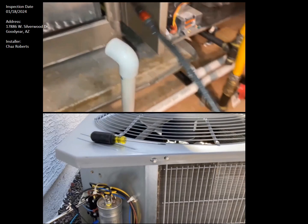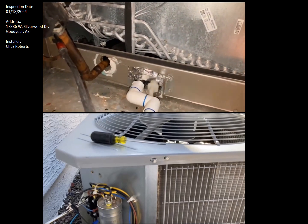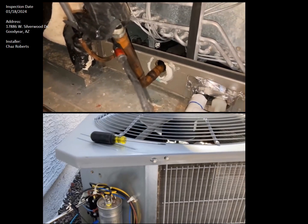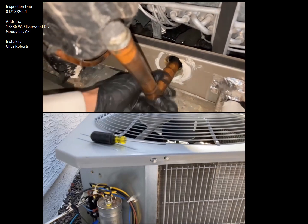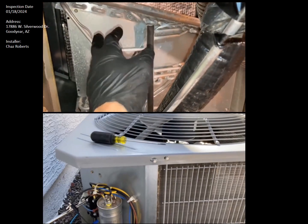Let's give it some fresh air and go right back to the aluminum-to-copper. At this time it is definitely confirmed that your copper-to-aluminum has a leak, and it is leaking refrigerant — that's where all this oil is coming from. We do need to address this leak so that when summer hits and you go to turn on your AC, it has enough refrigerant to run and cool the house as it should.